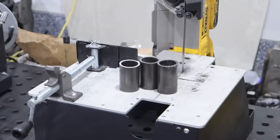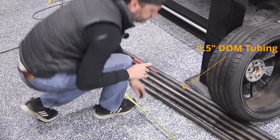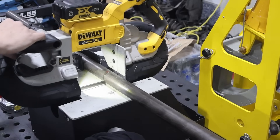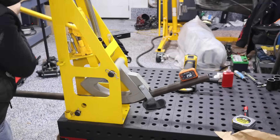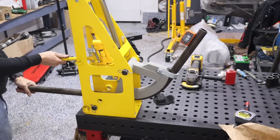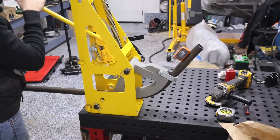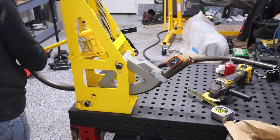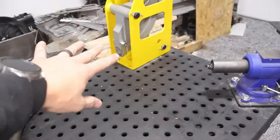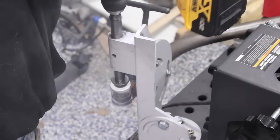We've got three of those all cut, ready to go. Next, we need about 48 inches to create those bend pieces, and we'll need two of them. We got this dialed in at 60 degrees — we'll measure to make sure we got the right length and then do the other side. I have two of these made now. There is a little bit of a learning curve, but the angles are pretty much spot on and the lengths are close enough. Now we're going to go ahead and notch the ends where they're going to be mounted to other tubes.